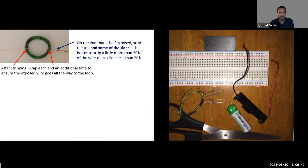When laying out parts on the board, be careful where you plug things in. Based on the width of the magnet, rows B and I are good choices for where the paper clips go. You want the same column so that your loop is straight, and make sure everything is mechanically stable. The battery leads can go into rows A and J. Without the battery plugged in, if you tap the loop it should spin on the axis of the holder a few times, meaning there needs to be good symmetry about the diameter of the circle. The loop wires should be very close to straight.